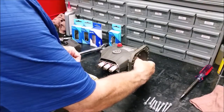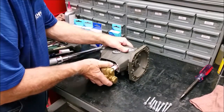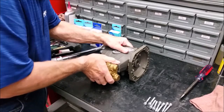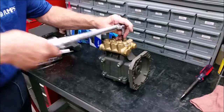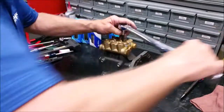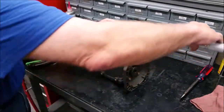To reinstall the head onto the drive end, rotate the crankshaft so the two outside plungers are extended equally. Install the head bolts and torque to 225 inch pounds using an alternating pattern to evenly distribute pressure.